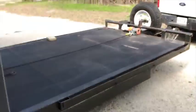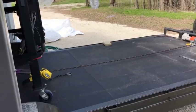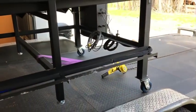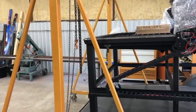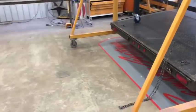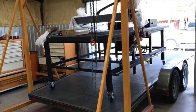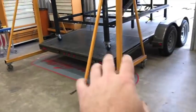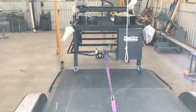Got it jacked up, got the casters on it, and I've got a winch hooked up to it. It's got a nice positive locking on the downward so you can easily let some out. I'm just going to roll this off the edge using the gantry crane to kind of set it off the trailer. I've got long ramps but they're super heavy, and getting those casters up onto the ramp could be an issue, so this is the easy way - lift it with the gantry crane, set this end off, roll it out, let the chain out.